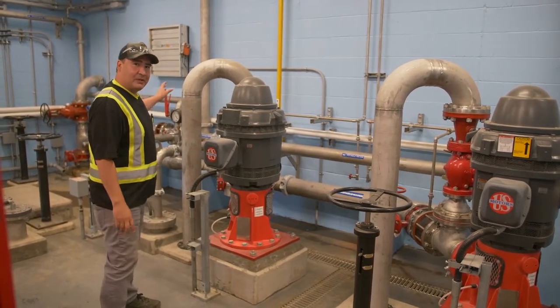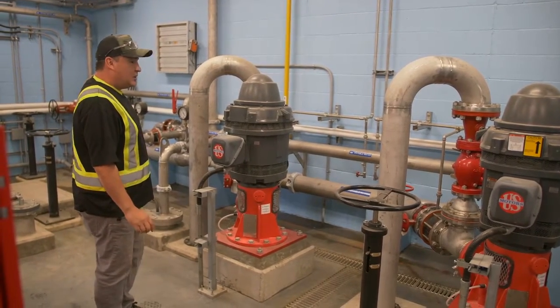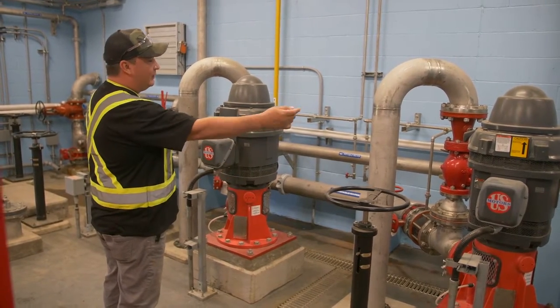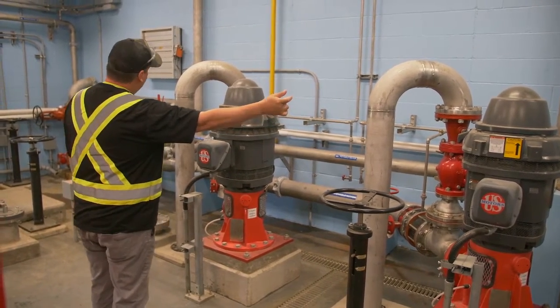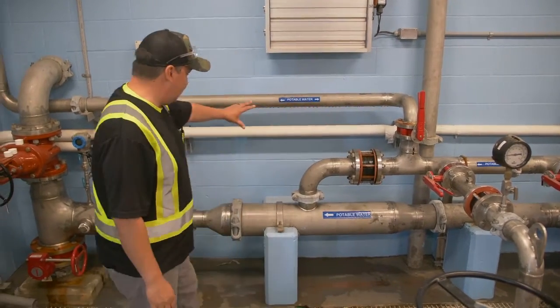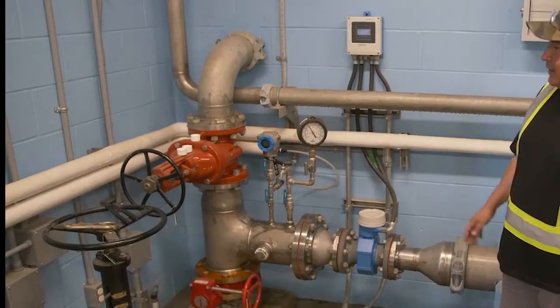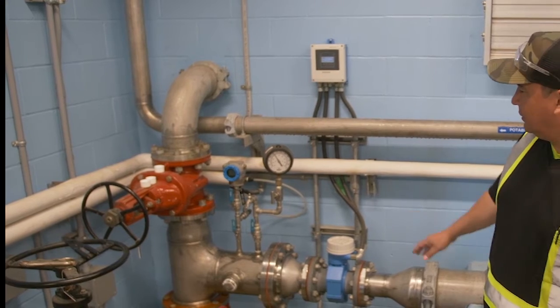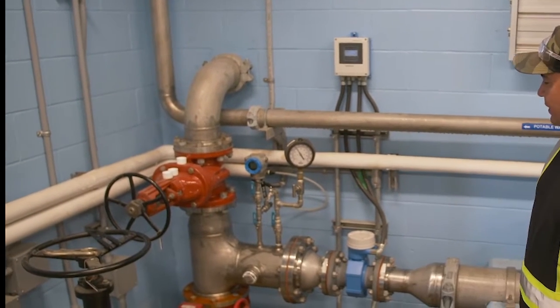This side too would have a fire pump and distribution pumps. Once those distribution pumps pull up water, they pressure up the line going out of the building and then out to the community. There are plenty of control valves so that you can isolate sections to repair any of the gauges or the flow meters.